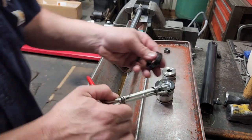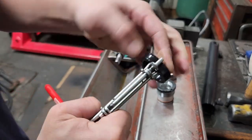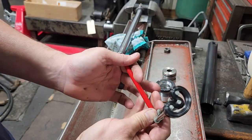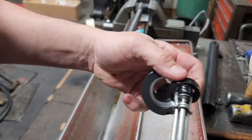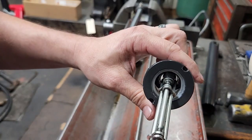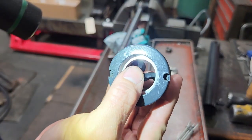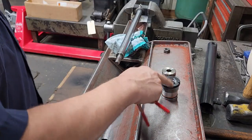I've got my seal installation tool here for the u-cup. Basically that goes in the tool like this, and then it deforms the u-cup, which allows you to get the u-cup down into the groove. Release — hold onto your u-cup with your thumb, pull the tool out, and then take it and that goes in just like that. Some of these newer u-cups are stiff and that tool aids in seal installation.